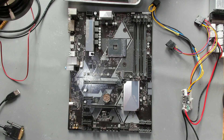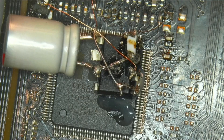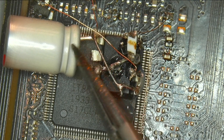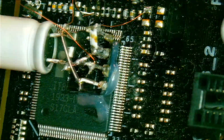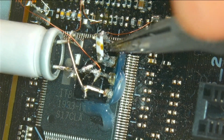The other thing was that this looked absolutely janky. Going under the microscope, you can see the close-up of what we have. The SIO is right here and on top of it I glued the 555 timer. We have connections between pads, a capacitor just laying on there connected to two pins, a resistor soldered on there floating in the air, and underneath a SOT23 component which is a diode connecting one pin to another via diode.